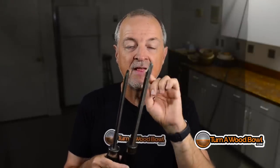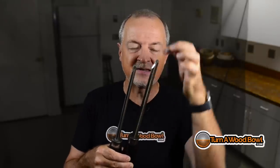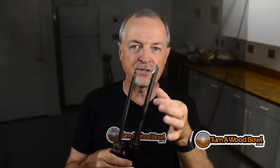Each of these tools can remove material — the bigger the tool, the more material can be removed. However, each of these tools has a point where the tip and the cutting edge becomes overwhelmed, and that has to do with several different factors: the wood itself if you've got a harder wood, the speed of the lathe, the power of the lathe, and all sorts of different things. But if you overwhelm the tip by trying to bite off too much, you're going to get catches.